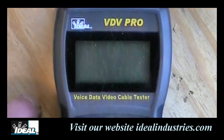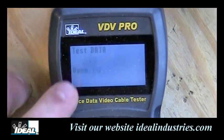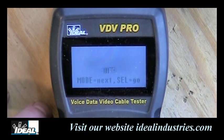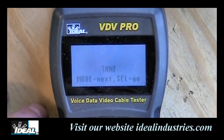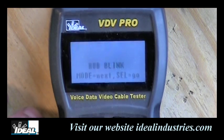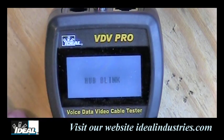So we'll do that by turning on the tester first, and any button again turns it on. And you'll see we're in that data mode, so we're going to hit this mode button until we get to that hub blinking feature. And there you go. Oh, one more, I think. And we'll hit the select button to get into that mode. Okay, now we're in that mode. It's in the test mode, as it indicates.